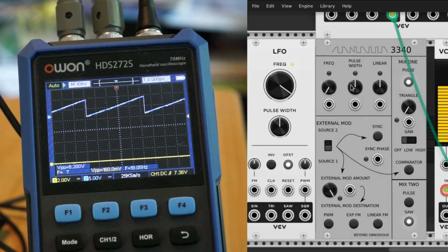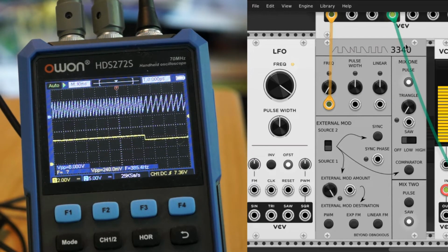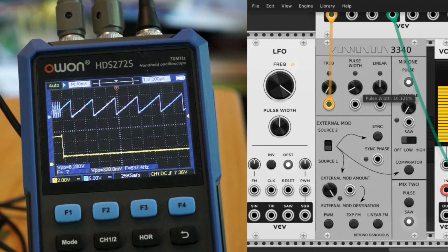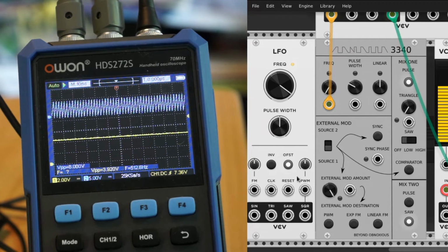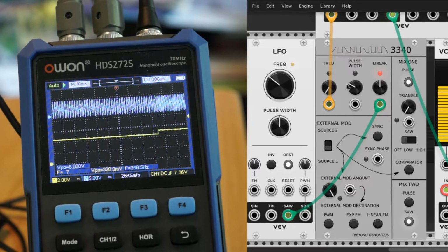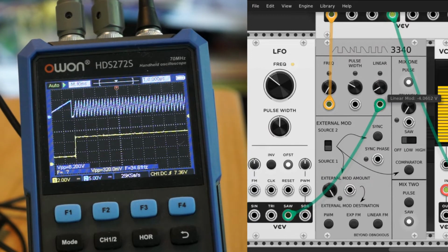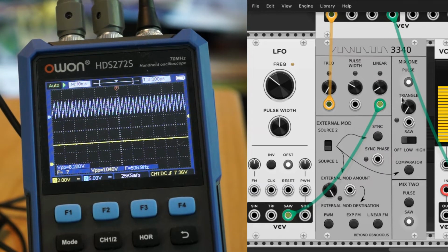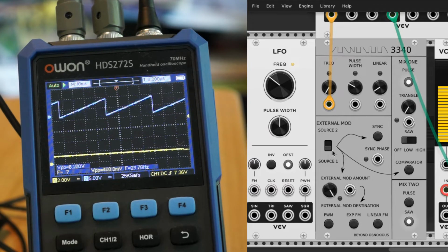We can do all the typical sequencing stuff. I'm using all the fundamental modules from VCV Rack. Modulate the pulse width of the square wave. Got a linear input to try to modulate that around a little bit. Clipping lights show if we're outside the range of the digital to analog converter. The range of the digital to analog converter might not be the same as VCV Rack stuff, hence the clipping lights there.